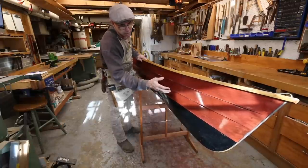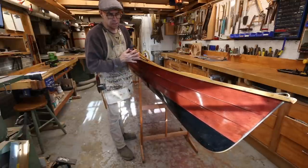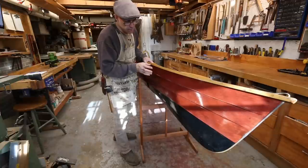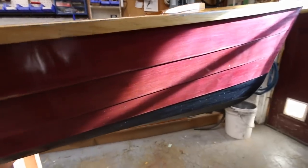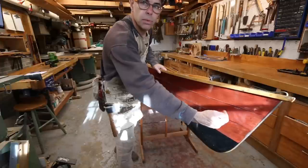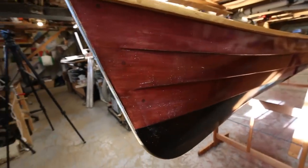The downside is you have to be very careful about brush streaks, and you can see how it's a little bit varied because of the brush streaks, especially if you over-brush. Another thing I learned the hard way is if you put too much pigment in, it sometimes gets a bit muddy looking. In some light it's almost a purpleheart color, but in other light it looks like a muddy brown. In hindsight I think I should have just tried staining this plywood rather than putting the glazes on.